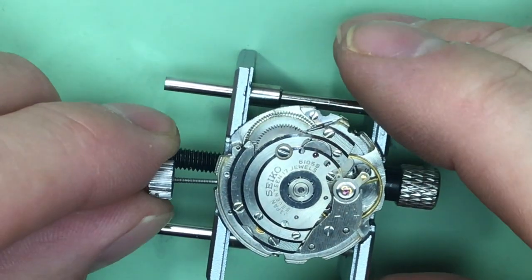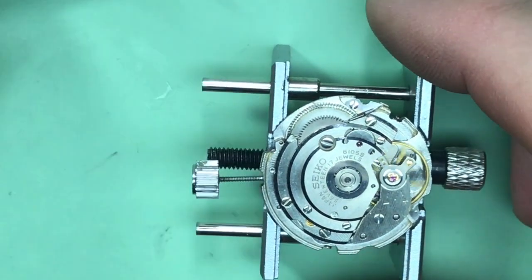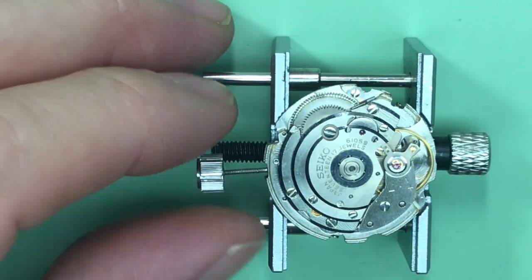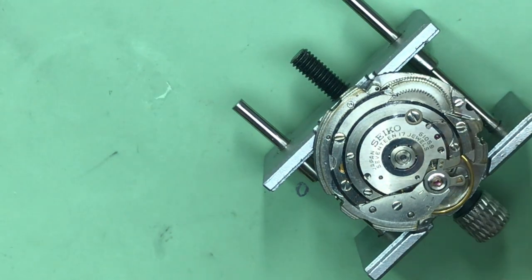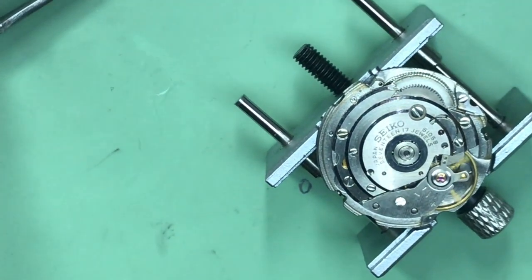Something interesting with your hacking mechanism. We've got the watch running, and now if I pull the stem it should immediately stop — but as you can see it doesn't. It wants to stop but it's not getting to zero balance movement. Let's keep going and pull the stem, then take the balance assembly off.